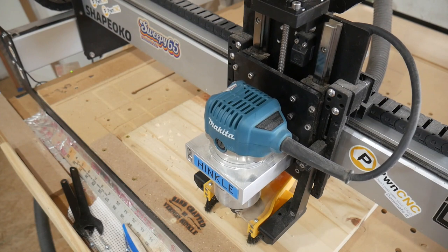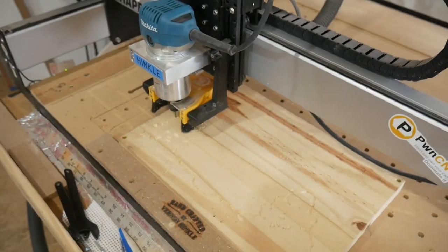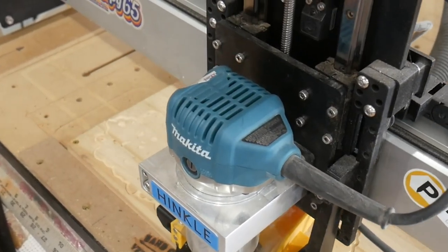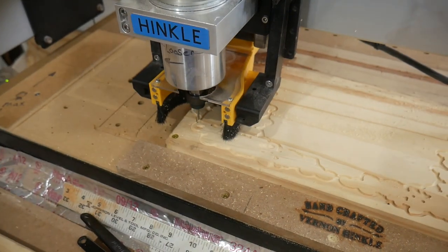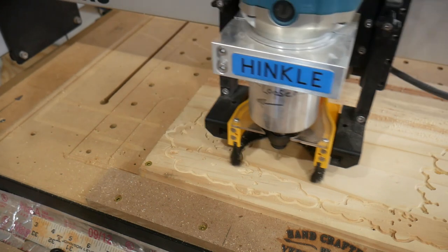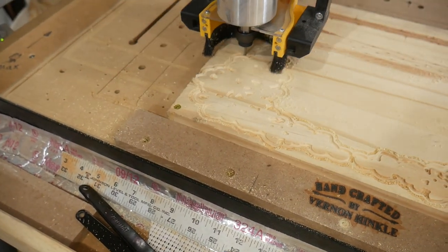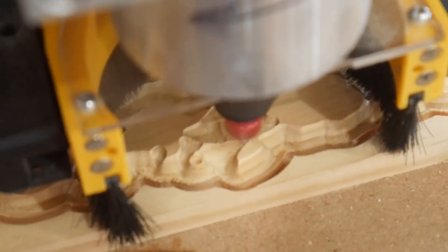This is the rose embellishment that we're going to put on the outside corners. This carve is limited to an eighth of an inch deep. We used an eighth-inch end mill to create the flats, then went back in with the V-bit to create the details. That thing can be mesmerizing to watch. I created an outside tooling path to cut it off — a 60-degree V-bit making the sharp points and doing the details.